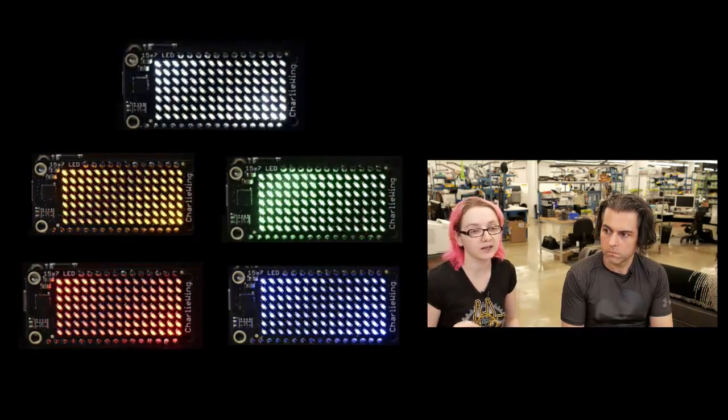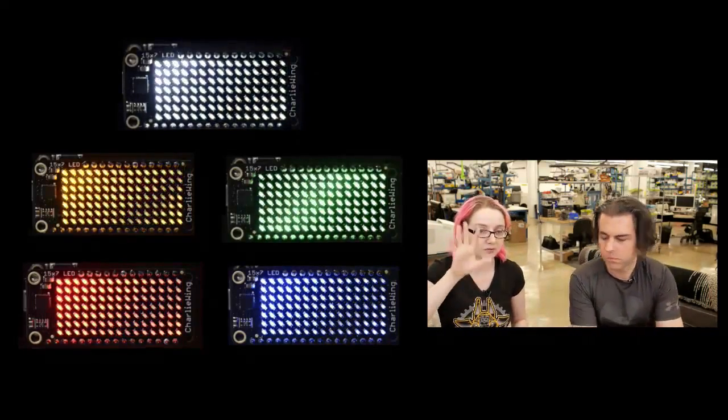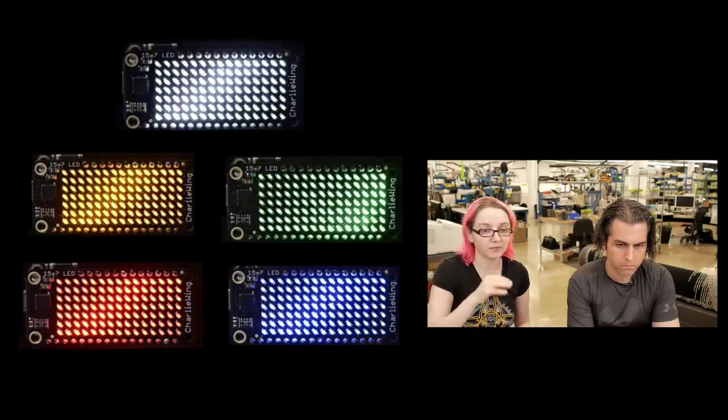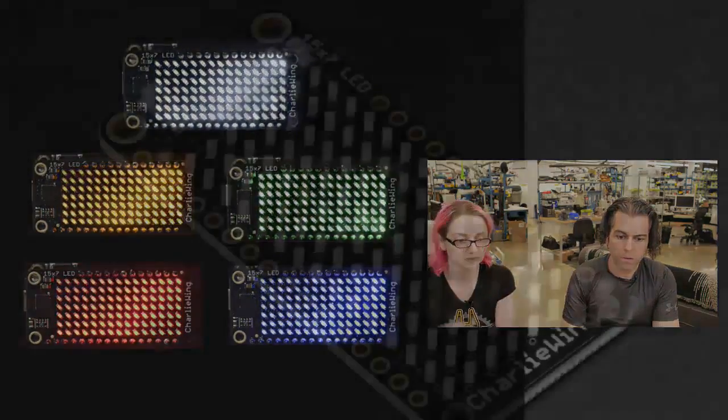Usually you can't do that. So each LED has 8-bit control. You can dim them, so you see this wave of color flowing through. That's each LED being PWM'd dim to bright and back to create a wave effect. So I can show that on the overhead. I have a couple other things. So this is just a photo.